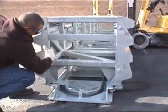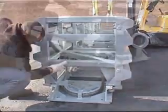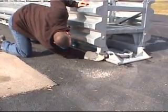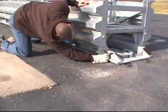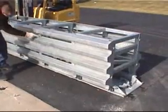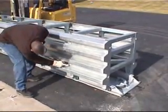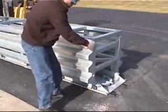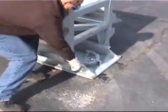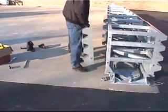Our front sled unit is very sturdy. Inspect the sled frame for any damage, then check the rollers that hold it on the channels. If there is damage, the sled should be replaced. To remove the sled, you will have to remove the side panels by removing six bolts, and you will have to remove the front stop bolts. Once these bolts are removed, you can lift the panel off.